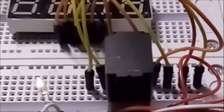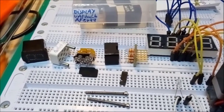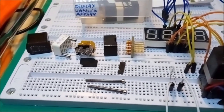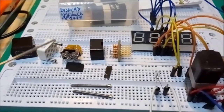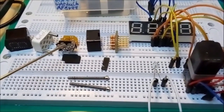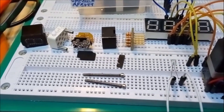So, yeah, well, that's the technology they use inside the display element you see on the right. And that's what we'll have to repair. So let me show you what exactly we're talking about here. So I disassembled one of the display elements because, well, at least in this one, two of the tiny light bulbs you see over here are broken and need replacing. Okay, so now just to show you how tiny this all is, have a look at my finger.